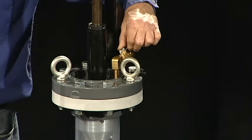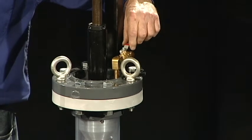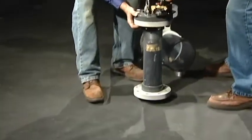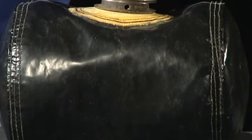When the plug is completely in the launch cylinder, close the tapping valve on the pipeline. Open the vent valve to depressurize the launch cylinder. Remove the launch cylinder from the tapping valve, then remove the multi-flex pipe plug from the launch cylinder and inflation ram and examine for damage.